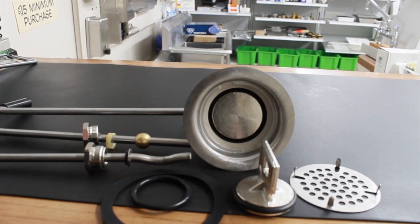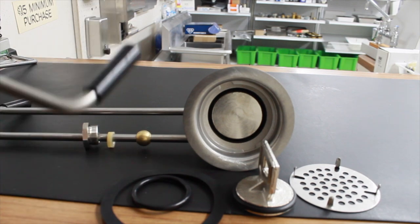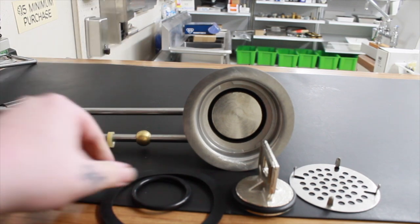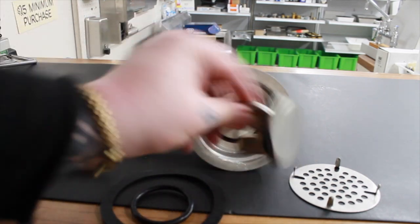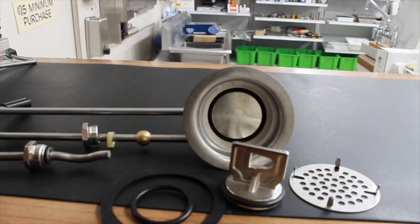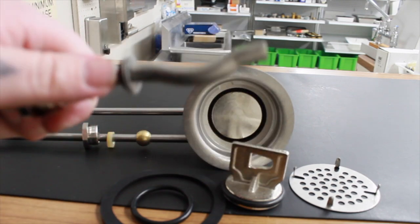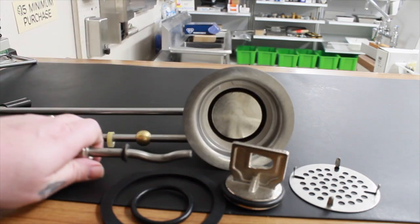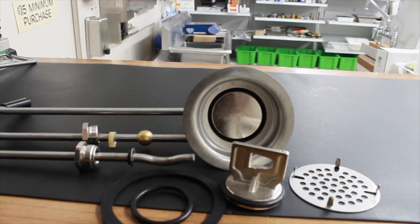Your standard lever drains also have a myriad of available parts: straight handles, standard twist-turn handles, flange gaskets, poppet O-rings, the poppets themselves, strainers, all your handle gaskets — whether it's the C-clips or the O-rings. Lots of available parts. The downside, because it closes with friction, is that you're going to need to have those parts available.